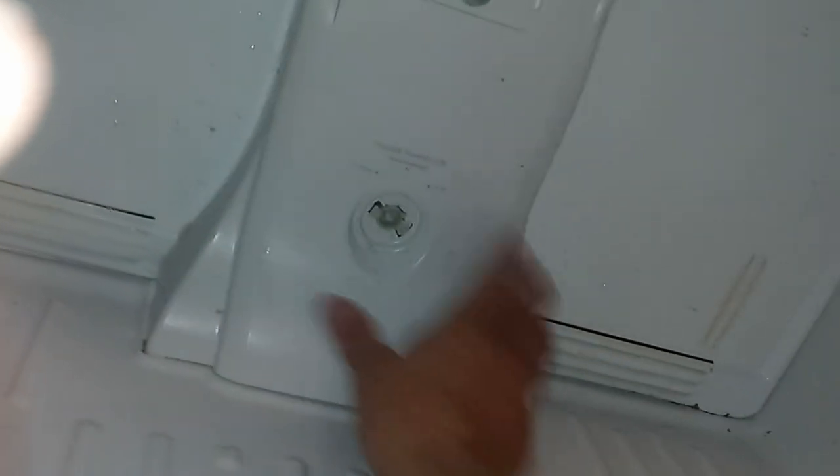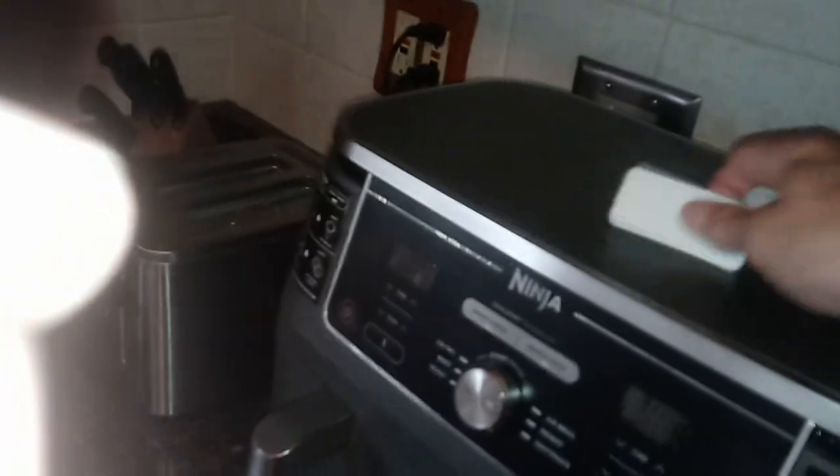So now the next thing to do is just put this centerpiece back on, and we'll just push it down, and it's got the four clips. So there we go, 1, 2, 3, and this side, and this side. Yeah, so it's all basically clipped in here. We just have to go ahead and put the screw in the middle, and then we'll take our little knob over here and put our adjusting knob for the temperature on here along with the one screw, and then put this cap back on here. Then we'll turn the fridge back on, put our food back in here, and ready to go.